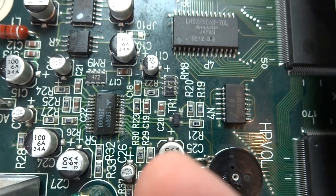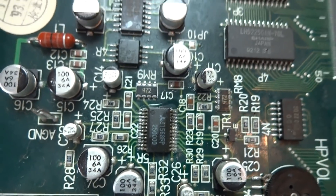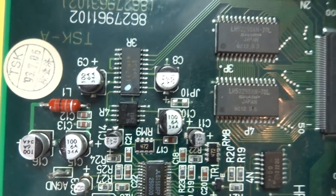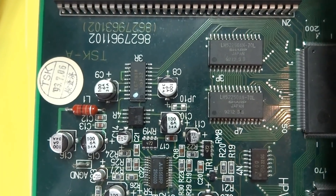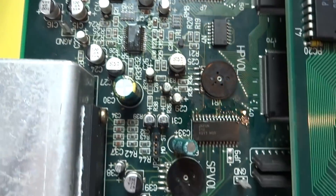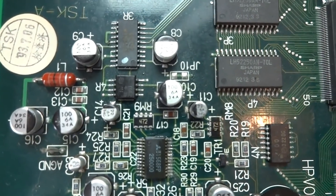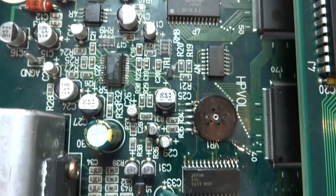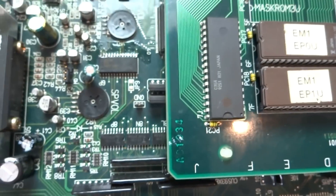Just these few capacitors I put in — there's actually another one underneath this board, and one over here in the corner — did help; it allowed it to turn on once or twice, but it's not consistent enough. I tried going around some of these chips where the legs were looking a little green. What we're going to do is pull off these caps and do basically a cap kit on this board. Is it really worth it? Yes and no — it's better than seeing it go in the dumpster, and it is a neat little puzzle game. The hardware has quite a few capacitors — almost like recapping a PC Engine — a lot of surface mount caps.